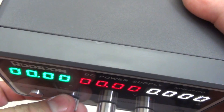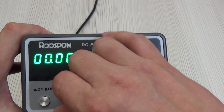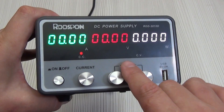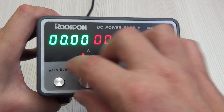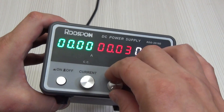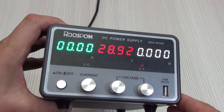The knobs are quite pleasant to the touch and have small circular notches. Under the display showing the current draw of the device there is a regulator with a stroke of about 340 degrees — the adjustment is quite smooth and allows you to achieve very accurate values. In the center is the voltage display, and under it there are two encoders for coarse and fine voltage adjustment. The right one has a large voltage step, while the left one allows you to adjust the voltage to hundredths of a volt.